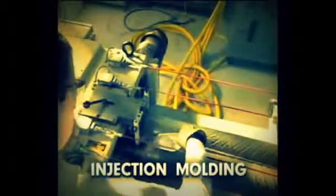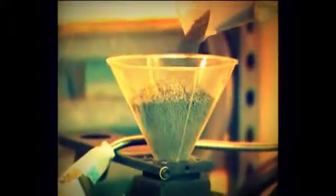Injection molding involves mixing the powder with a thermoplastic binder and granulating it to produce the feedstock. The feedstock is heated and then injected into a mold to produce the desired part. Once the part hardens, it is de-binderized and then sintered.